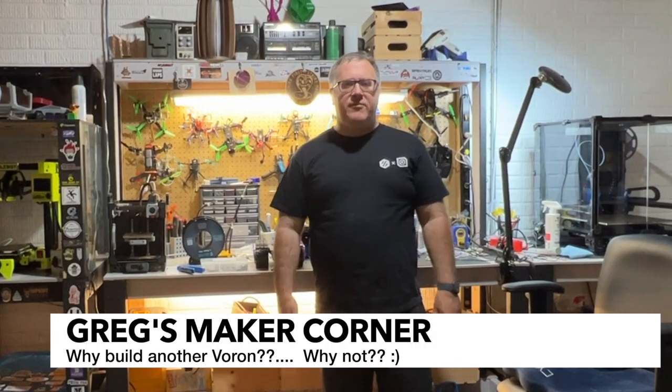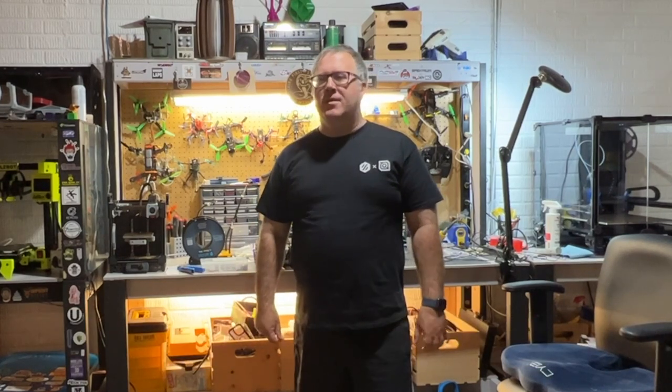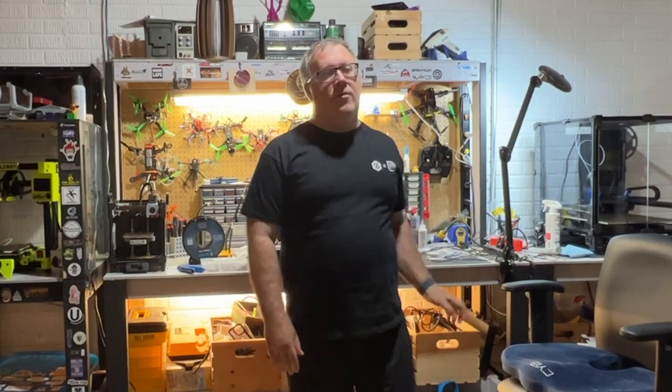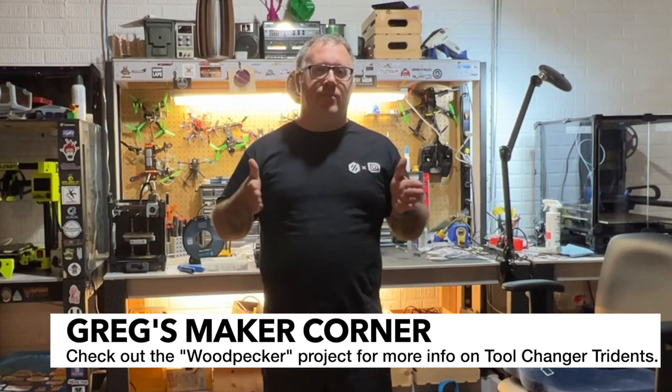So you may be wondering some of my rationale for building a Voron Trident, and why I want to add that to my collection since I already have several Vorons. Well, the reasons are more than just trying to collect them all, although that is definitely fun too. I really do like the Voron ecosystem and I think there are obviously differences between each Voron machine. The 0.1 is great for small parts, very fast, fast to heat up. The 2.4 is also a great machine — it has a flying gantry, so it's definitely a fast machine. One of the reasons I'm looking forward to building a Voron Trident is to have a tool changer, which is a lot easier on a Trident versus a 2.4, as the gantry on the 2.4 is moving around up and down. Whereas on the Voron Trident, everything is fixed — the gantry stays in one vertical position while the bed moves up and down.